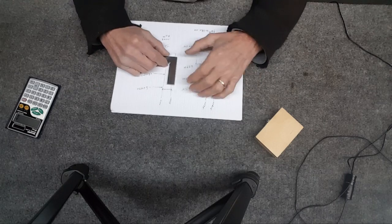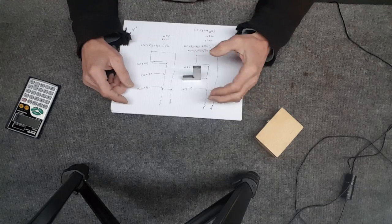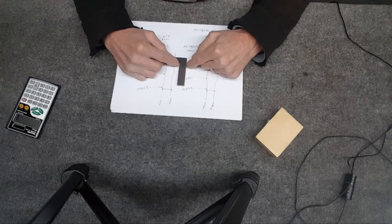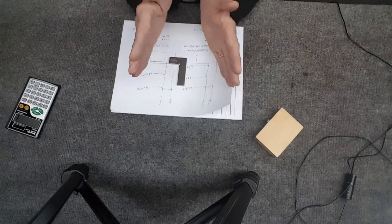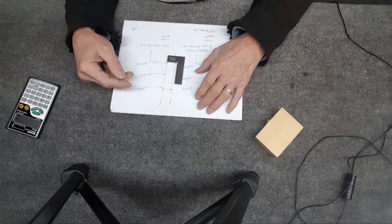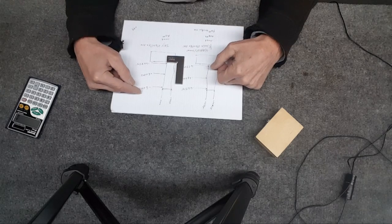So what to say on this guy? I did a lot of research on YouTube how to check the squareness of a square, and there's quite a few videos out there, but to do it, the first thing you have to do is make sure this is absolutely parallel, because in the other test, checking the squareness, if this thing is bowed this way or this way, you won't even know. It'll say the thing is perfect. So the next piece I'm going to show is just checking both of these guys for parallelness. I check here, here, and here, and I've already got the numbers written down.